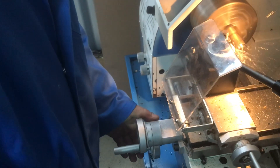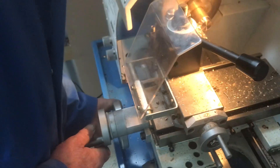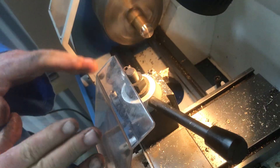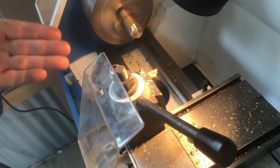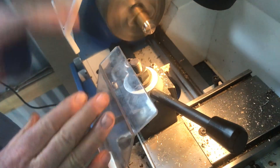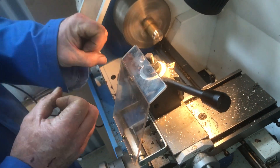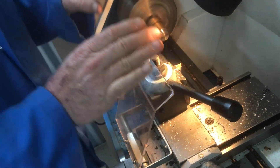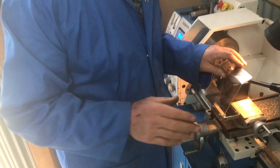Watch for tool build-up — it seems fine here, but keep your eye on it. A lot of people actually use high-speed steel on brass; you can use tungsten carbide — bring your speed up a bit. It depends on your machine and the diameter: bigger diameter means slower speed, smaller diameter means faster speed. Those are just some very fundamental but important things about using tungsten carbide. Thanks — hope the clip helps.